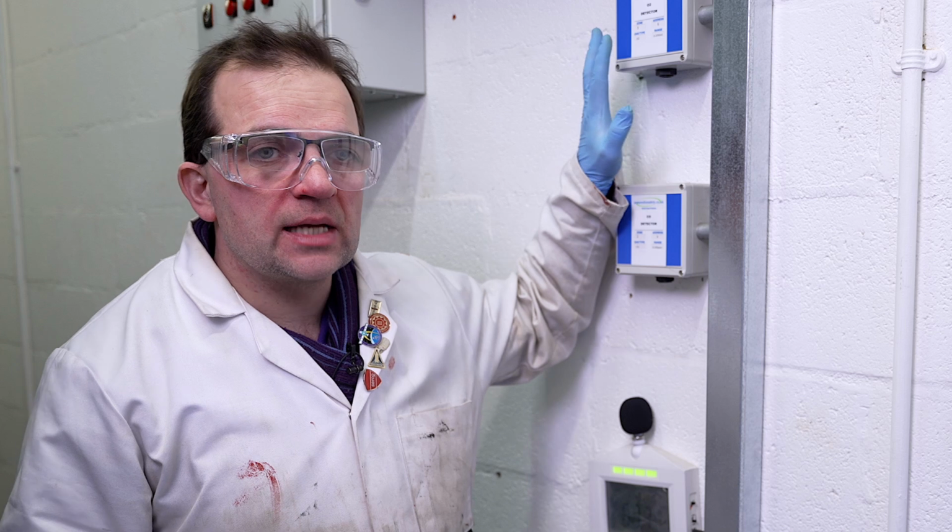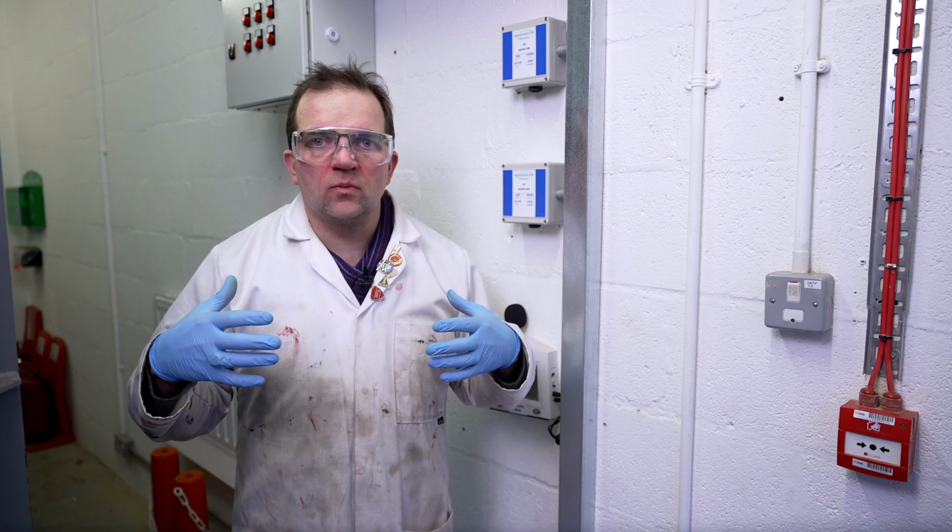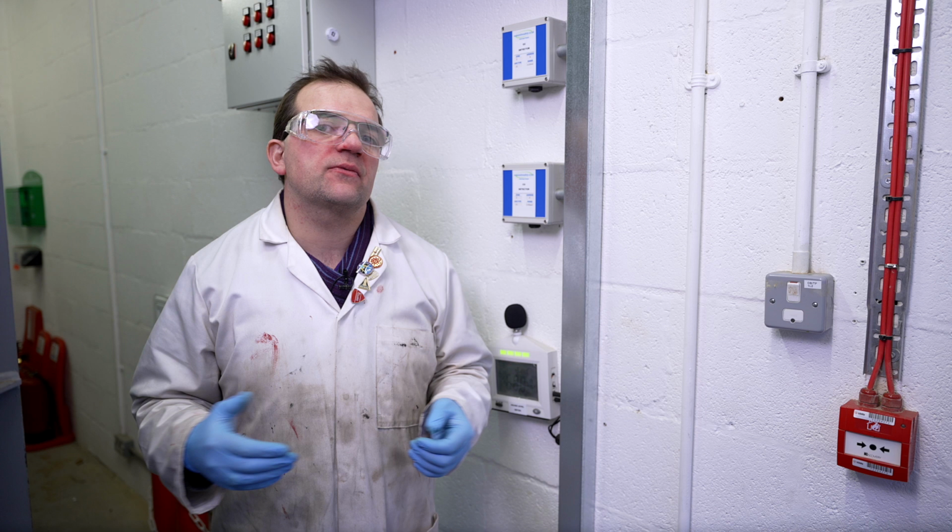So here in the test facility we manage, we have sensors outside of the test cell, where we've got some of the propellant feed lines and feed systems, but also we've got equivalent sensors inside the test cell as well. We've had to take extra precautions because we are test firing in a semi-enclosed environment. But some of these precautions you may want to think about for your test environment, because if you are firing in, let's say, an open field, or open air, then some of these stringent requirements may be relaxed a little. But please do the health and safety and the risk assessment on your site specifically, and do talk to professionals about getting the right advice. This is a very serious consideration, and don't overlook it.